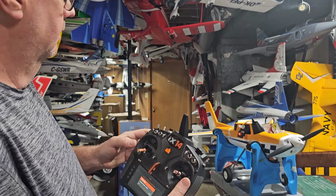Now, my throttle cut's on. Timer start. Timer stop. Timer start. See timer now? Stop. Okay. Timer start. Stop. I'll disable that in a minute. So if you look at my rudder, rudder works. Okay, so I know I've got proper communication. I'm not worried about the direction of the travel. I just want to know that the receiver is receiving signal and they're talking to each other.